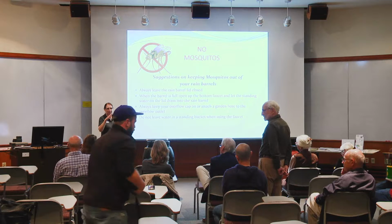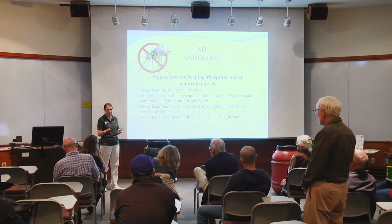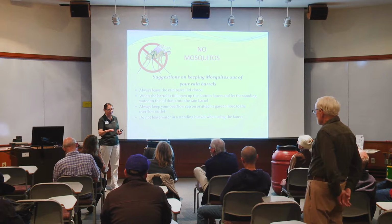Generally, with water features, what we recommend is that you don't leave them running 24/7, because then you'll get black flies, those little buffalo gnats that have the nasty bite as well. They survive in the pump filtration system and in areas where the water's flowing across the walk. If you have a little waterfall, sometimes you'll see these little black grubs that show up on the rocks. Those are black flies. The remedy is to just turn the pump off and let everything stop flowing for about 24 hours once a week. That'll kill the black flies, but it's not long enough for the mosquitoes to grow.